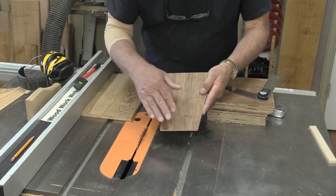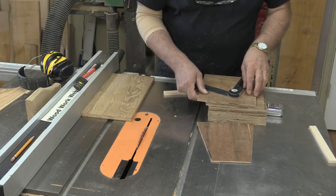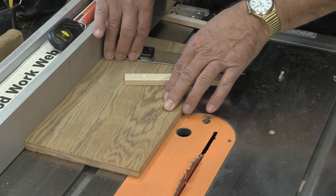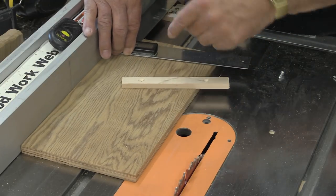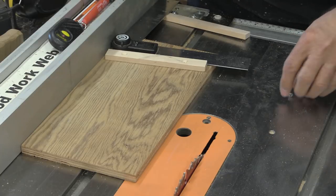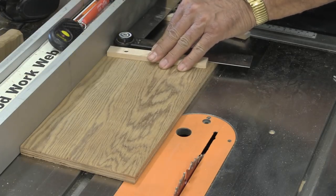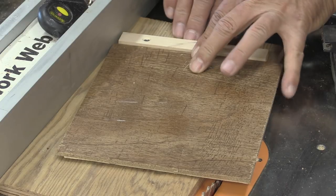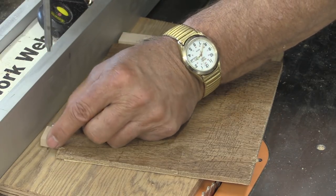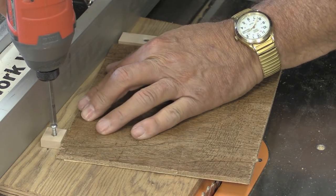The next thing I need to do is make this form — it's just a piece of plywood — and there's all the plywood that I've already cut. I need to make a bunch of these exactly the same as this. I want my angle finder against the fence as well. I just drilled a couple of holes in there, so it's easy to put some screws in, and I'll put just one in one side so that I can pivot it just a little bit. I want this piece right up against the fence, the back is tight here, and I'm using a pan head screw in this small piece of wood because if I use something else it will split that wood.